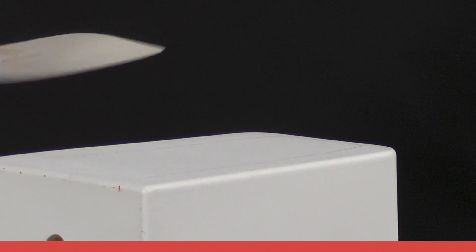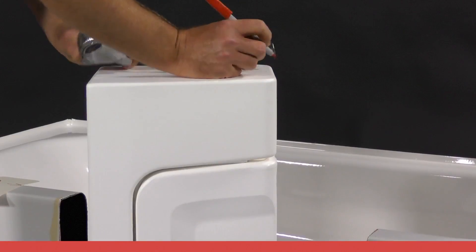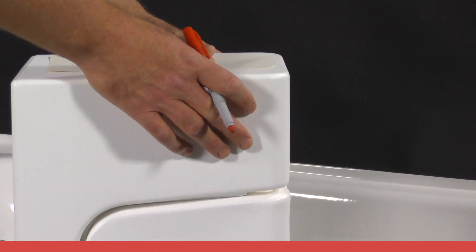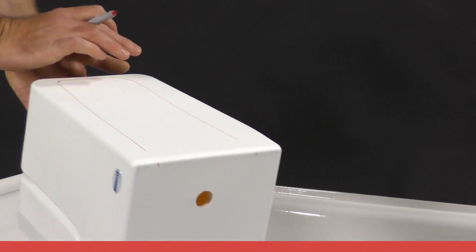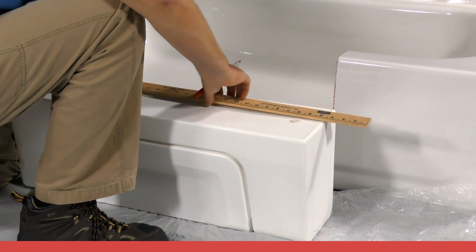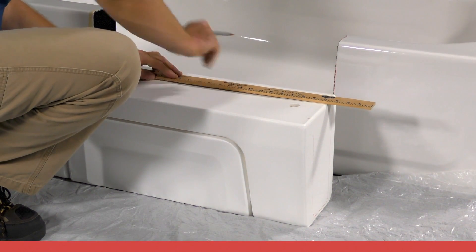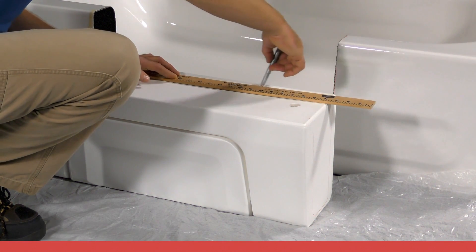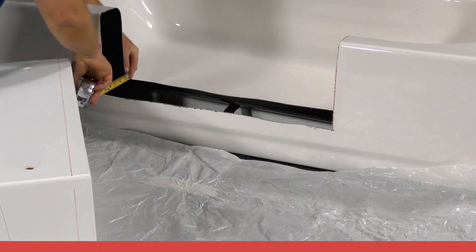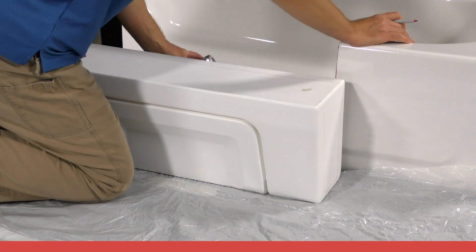Trace the outline of the paper onto the product and continue the lines with a straight edge down and around the corners. Repeat the same procedure for the right end of the product, remembering to place the paper template the same distance down from the top. Next, connect the bottom edges of the CleanCut product and connect each side of the outside tub line using a yardstick. Use a tape measure and transfer the shape of the inside tub edge to the CleanCut product, taking measurements every three inches from one end to the other. Once completed, use your yardstick and marker to connect the markings for the inside line.